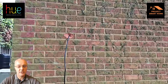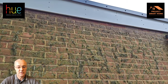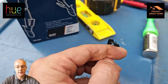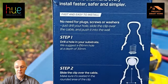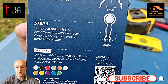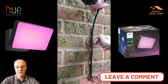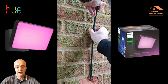On the other side of the wall, unfortunately the wall's blown out a bit as I've come through. The black cable that goes into the switch fuse spur has come out the wall there. I'm going to run that cable up the wall vertically, then across horizontally to the middle of the wall at the top where I want the light. I'm going to fix the cable in place with linean clips — I really like these, they're very discreet. They just wrap around the cable, you drill a hole in the wall and knock the linean clip into the wall to hold the cable nice and tight, so you haven't got cable clips sticking out all over the place.